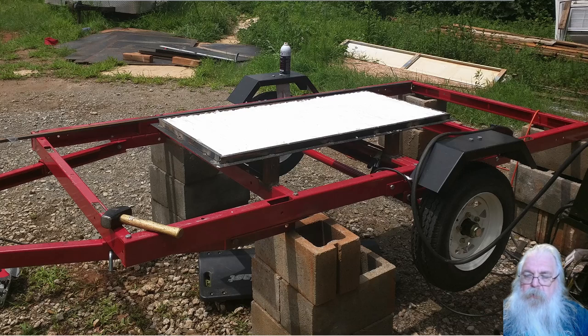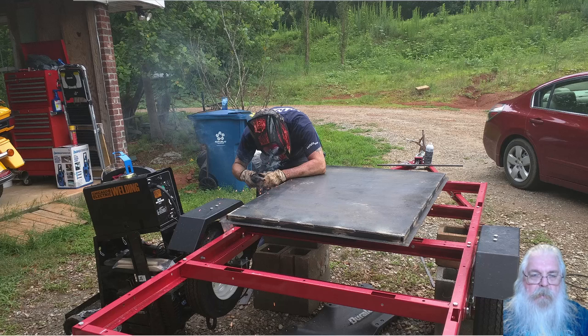This is the base here. We've got 1 inch of rock wool insulation in it, and then we're putting on 10 gauge steel. The exterior skin of this is 14 gauge steel, the inside of the smoker portion is all 10 gauge steel, and the firebox is quarter inch steel. That's what I had available to build this with. There are places where I wish I had gone to a heavier gauge steel on the exterior, because it did have some warpage and some issues. But I do like the results of the smoker.